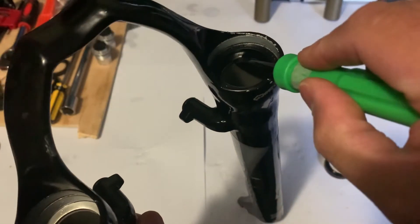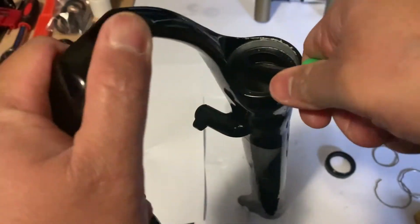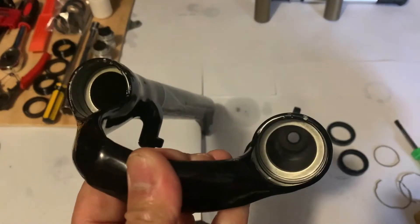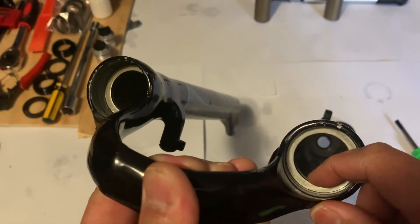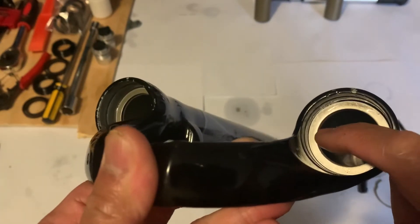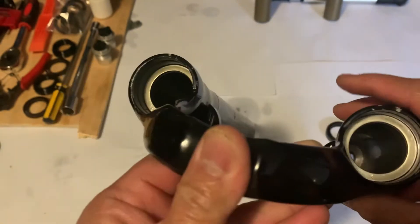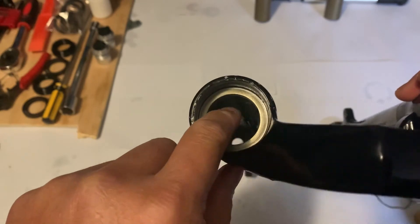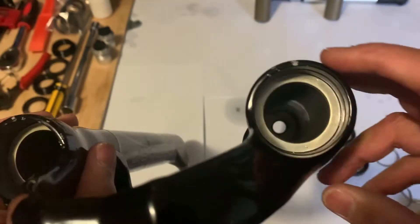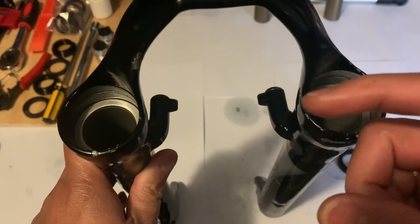Similarly, position the flat screwdriver underneath the other oil seal and give it a firm push upwards. Now both oil seals are out. You can see there's a washer on each side. At this stage we are not planning to change the pilot bushing — this piece inside — because everything is still okay. We check inside and there are no major scratches, just some minor ones, probably from old servicing with a screwdriver. We've cleaned up using isopropyl alcohol, cleaning inside with a long wooden stick and rag, and just need to clean the edges to make sure there's no sand or grit. After that we will replace with the new oil seal.